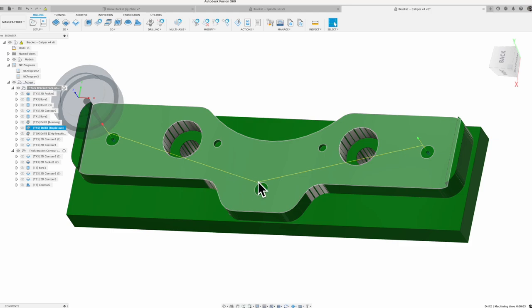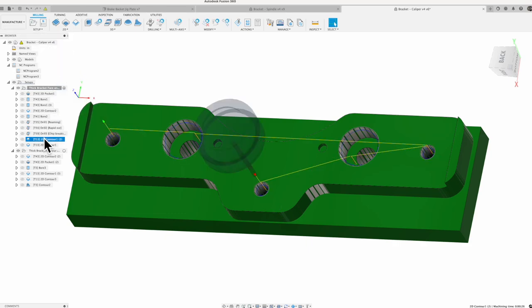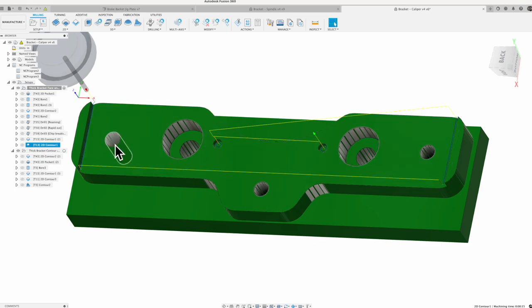And then we've got the holes that we need to tap drill over here. So we're going to tap those M12 by 1.75, put a quick spot drill on those, drill the tap drill size, and then I'm going to go through and put a chamfer on those. I have not had good luck rigid tapping for holes 1/2 inch and larger on this Tormach. It might handle it in the aluminum. I don't think at all that it's going to handle it in that 4140, so I may as well just find a way to hand tap those now and make sure I'm doing the prototype the same way I'm going to do the finished piece.